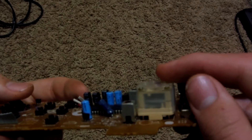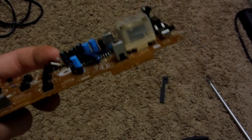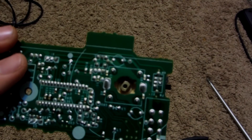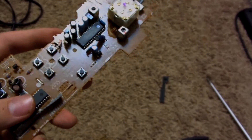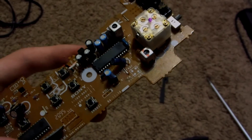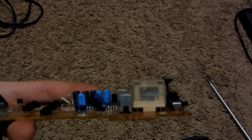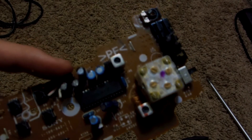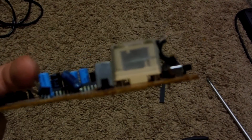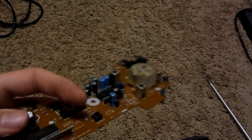Other than that, this is a pretty low-grade board. There's this little weird box here — this is a variable capacitor. Whenever you change the stations, there's a little head that spins, and that tells you what station you're going to tune to — what frequency and stuff. If you take one apart, there will be a whole bunch of layers of plastic and metal, and they turn whenever you turn that little knob at the bottom.